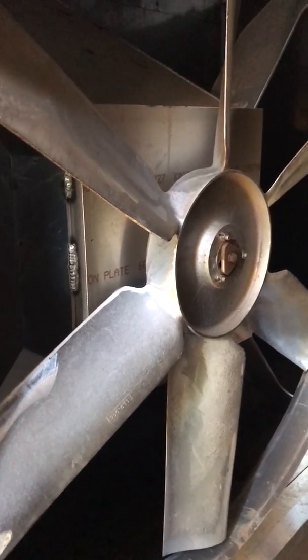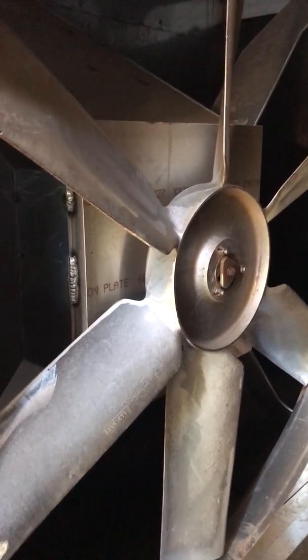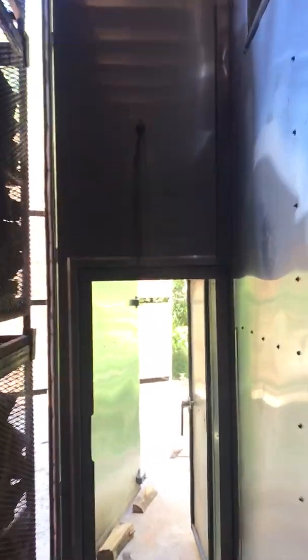When the system flips, this will actually run forward now every three hours, and that fan over there on the other wall will run in reverse. These are our return vents, which I showed you on the outside — there's one on each side of the kiln that pulls the air out. We've got four temperature monitors in each corner of the kiln, just monitoring for even air heat throughout.